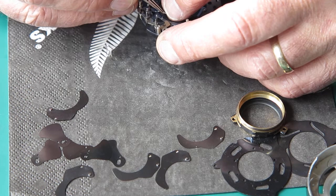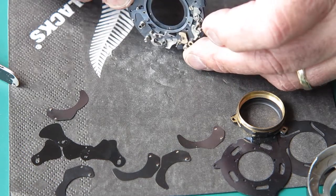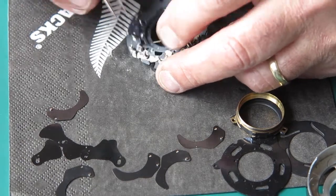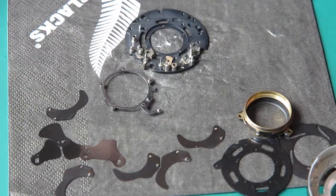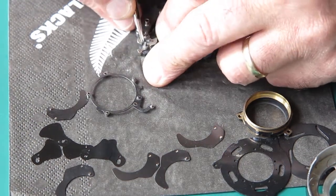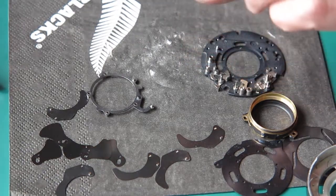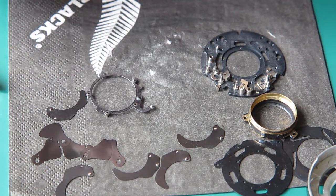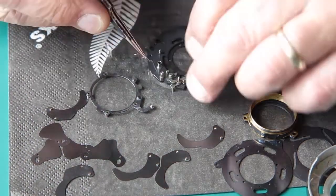Get that detent swung into place. There it is. Yeah, that detent's still off. It's got a kick. It kicks upwards at this end, and I think that's likely to potentially cause a problem. So I'm going to do a bit more work on that spring. It may potentially catch on something sticking up like that. It's not all lying in one plane. Let's try that.